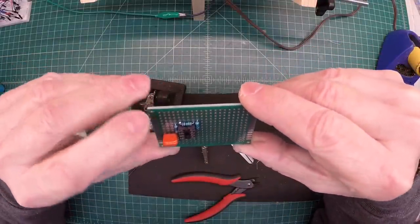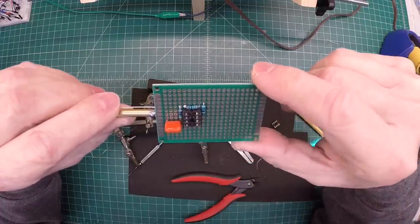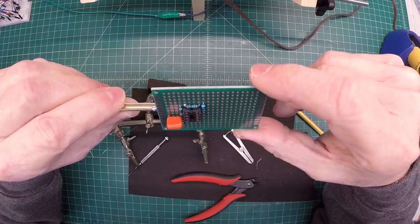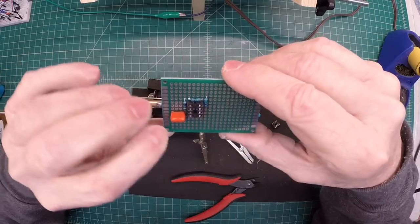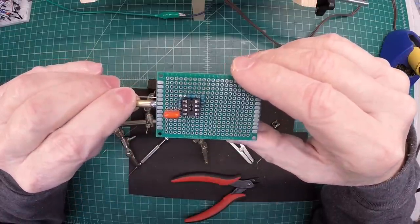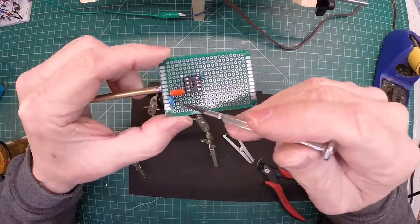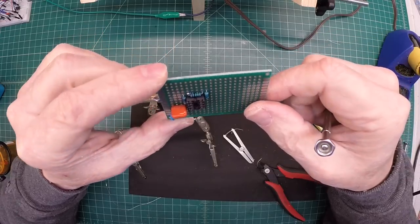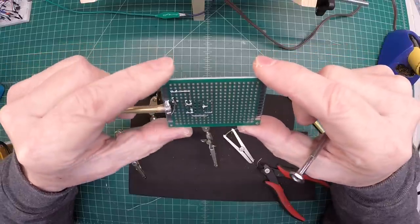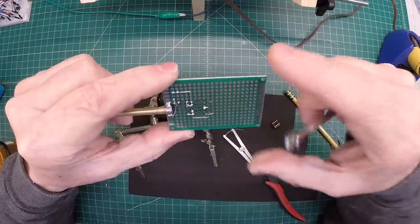You can see I've got the resistors in there — R1 through R3 — close to the integrated circuit, that being the 741 op amp. Let me go ahead and get this other cap placed in so we can form the ground connection routing as well. Here's a look at what I've got mounted so far — the components are pretty straightforward. The back side routing here will be easy to create a circuit board for this design.